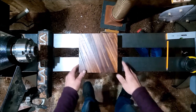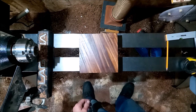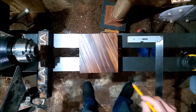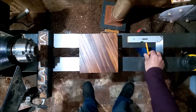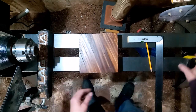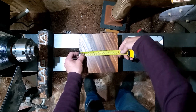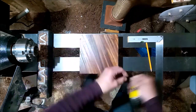Okay, right, I'm recording this after I did the video to try and better answer a question I was asked. The question was, how do you make sure that the ball is central in the wings? It all starts, before you even go near the lathe, with the blank. The blank has to be exactly square. This one is 7 3/4 by 7 3/4 exactly.